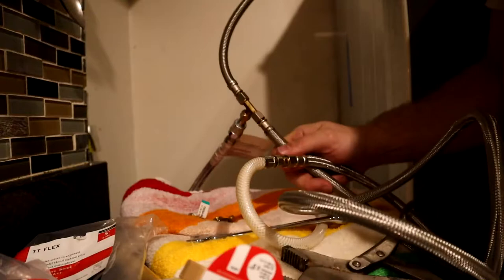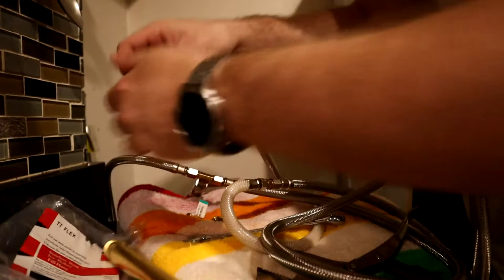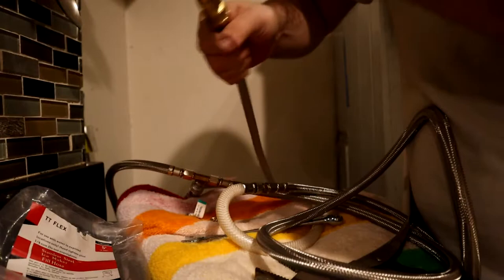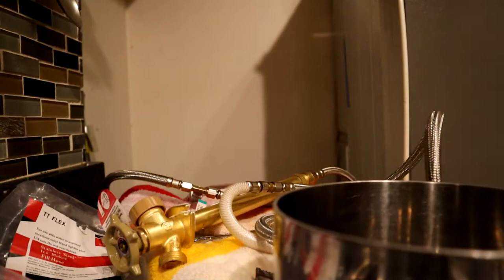Okay, so there's my T-adapter placed. This goes all the way up to here and all this is still done without any Teflon tape, so if I just cinched these down really tight this is absolutely acceptable — up until the piece that is brass on brass, which would need to have thread tape, so it's probably gonna leak a little bit. The question is how bad is it gonna leak, but like I said, proof of concept. Let me go turn the water back on. We'll get a bowl or a pot ready and see how bad this leaks.